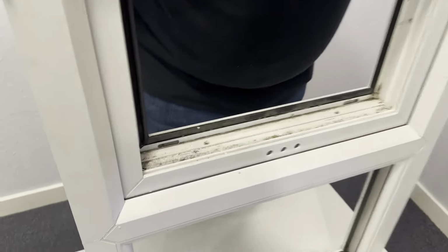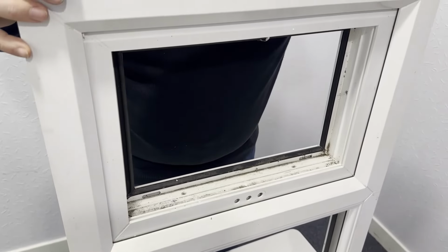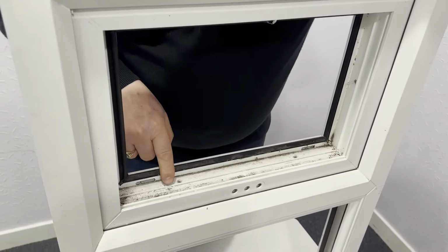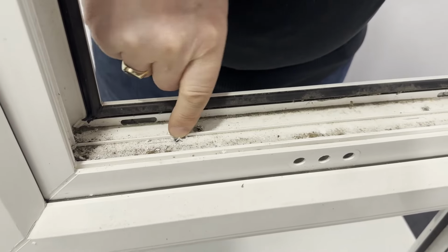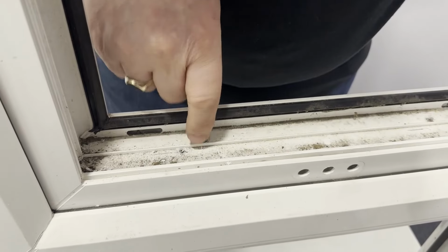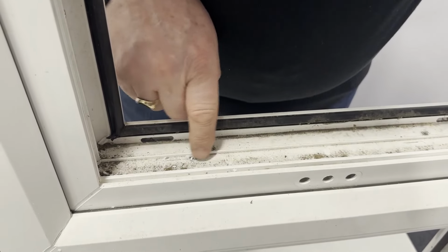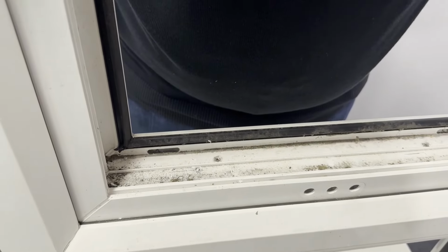Right, that's that 4mm pilot hole drilled. And now we'll swap the bit out for our 10mm. But just to point out at this juncture, if we discover as we progress that a single hole is not adequate to make us enough room to rock backwards and forwards with the implement we're going to use to try to move the mechanism, then clearly we will need to elongate this hole by drilling 2 holes at the side of one another. But if we have to get to that stage, it will explain itself a little bit further on in this video.